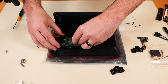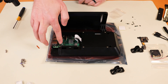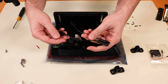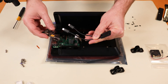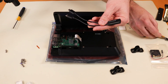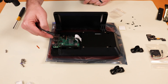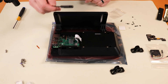We're going to pop the Raspberry Pi down — it's okay if the ribbon cable bends a little bit. Notice also that I'm not putting the PoE hat back on. I realized that this cable is going to power both the display screen and the Raspberry Pi, so I really don't need the PoE hat. I'll save the PoE hat for some other project and just power this with this single cable. I'll still need network connectivity, and I might actually just switch on the Wi-Fi on the Raspberry Pi to display those feeds instead — though hardwired is always better with camera stuff.